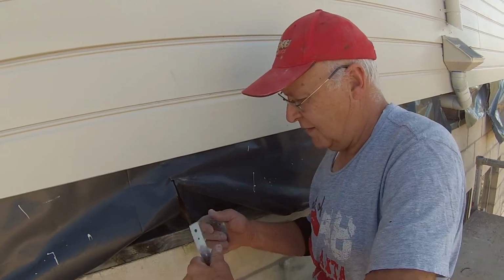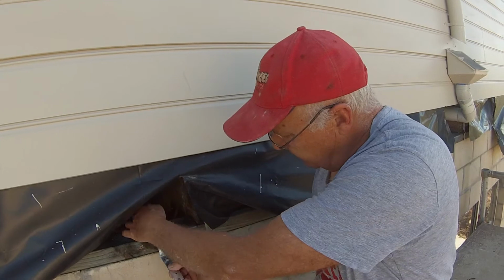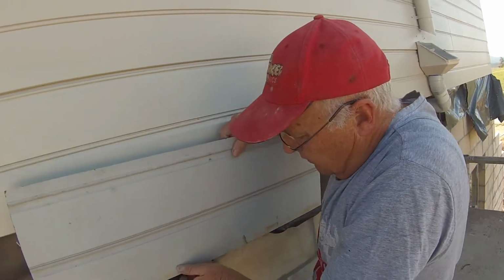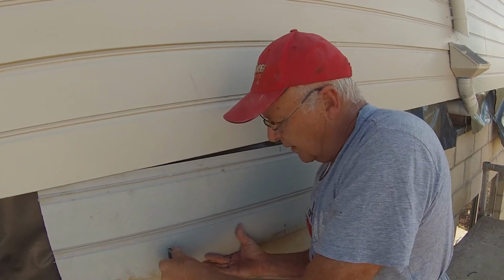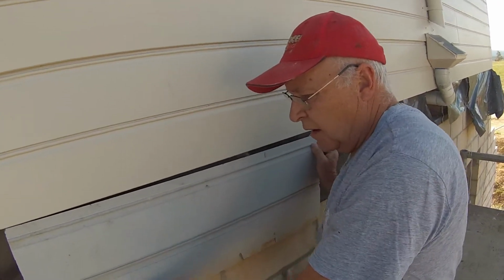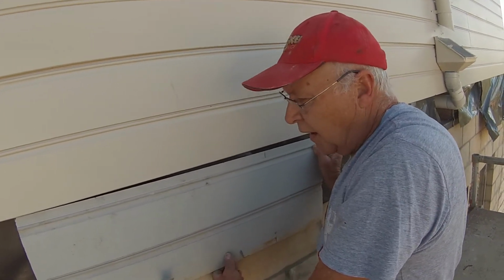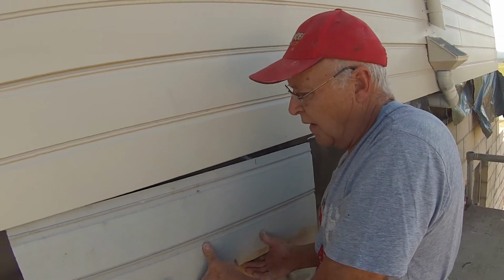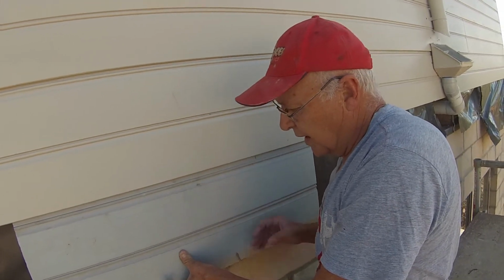Enter the jig. This is a bit of strapping line. I've bent that so it clips around the top plate. Put the board in place below the other one and bend the end up. And that will sit there quite easily. I'll put a second jig up the other end, and then I can slide the plank sideways to push it into the joining strip, and then just lift the plank up and lock it in at the correct level with the other one.